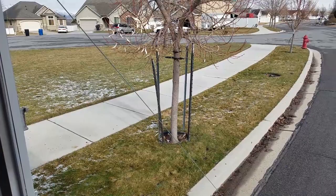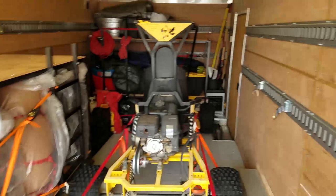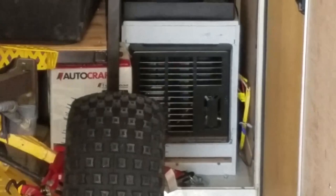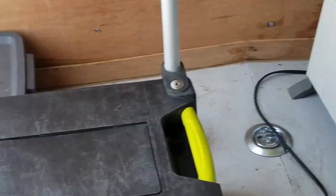There's a little bit of snow on the ground from a storm that probably completed yesterday. It's jacket-worthy outside, but I'm going to try to heat the trailer with this furnace I put in here. It's an RV furnace, so it vents to the outside — just a heat exchanger to the inside — so there's no risk of carbon monoxide or carbon dioxide, no oxygen consumption, because it all vents to the outside.